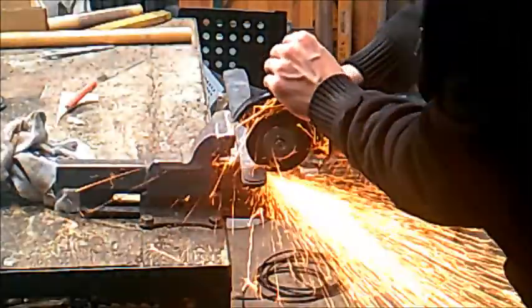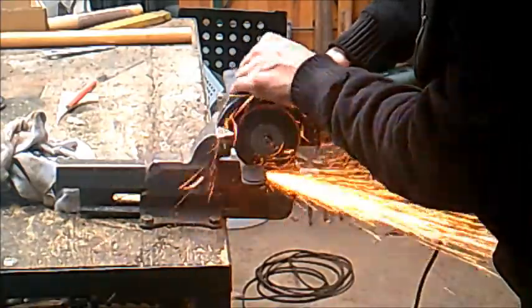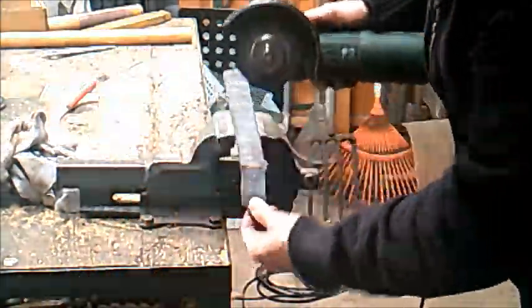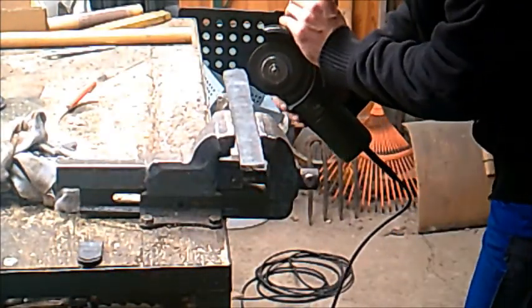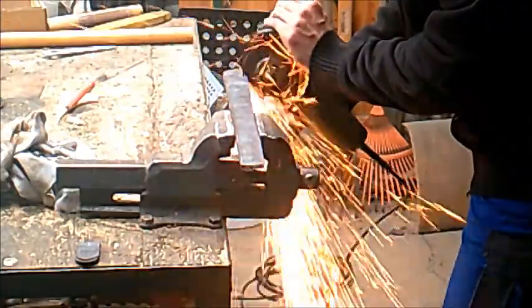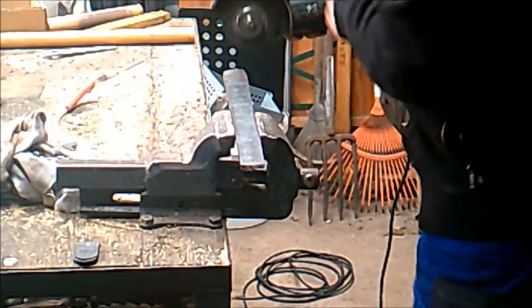You now see how I cut away some pieces of the Damascus, because they are split and they were not so well forged, so I just cut them off. This billet of steel is one part manganese steel and one part chromium steel.